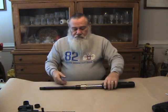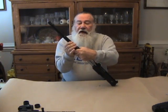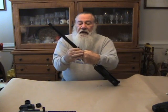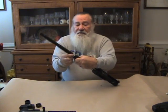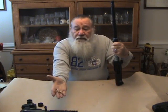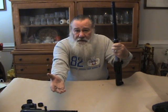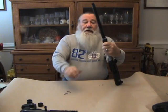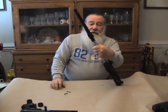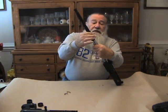Next in line. Now, this is where you gotta be dang careful. Slide your bolt down and move the gas piston housing down, and these two little tiny portions will fall out. It's like a washer that's been cut in half. Now, without those things, what can happen is your gas piston housing can slide up the barrel. So if you forget these first time you fire it, that boy is traveling, all right?